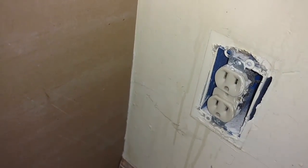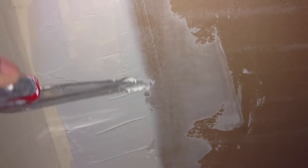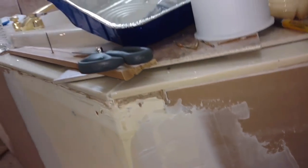A few screws hold it in. Cut this hole here. Press this so tight against that edge that I may not even have to caulk that. Just paint that in, but I'll probably put a small bead of caulk on it. Not as ugly and sloppy as they did there. Just a small bead. Put some joint tape on this crack. I put on joint compound, then I lay the tape. Then you run your putty knife up the tape so that it eases some out and gets on the edge of the tape. Then you put a little more on there. If you've got a fat putty knife like this, put a little bit of pressure on the edge, ride it up, and you have a nice, pretty smooth finish like that. Then I do the same on this side, ride it up on the edge, press it hard on the opposite side.